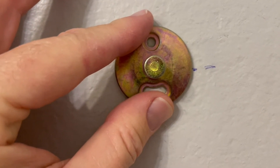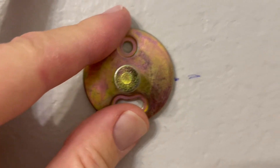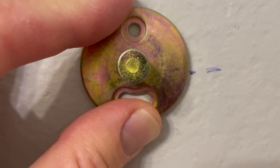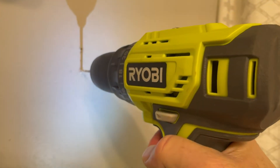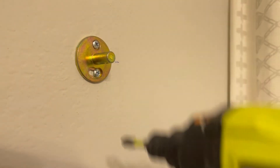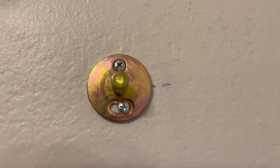Leaving a little bit of room on the side and making sure that centerpiece is right at the height it needs to be, I'm going to go ahead and mark the top area as well as the bottom area, and then we're going to drill a couple holes for our screws. That bracket is now in place — ready to stick another one on the other side.